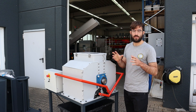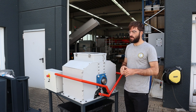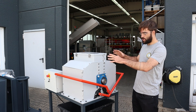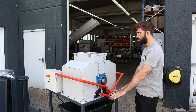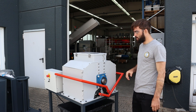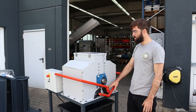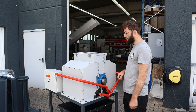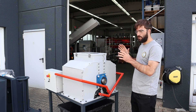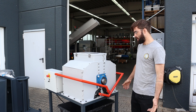Now Weimar is going to work on a second version of this shredder to improve the ergonomy, the safety, and the use of the machine — simplify it a little bit. Globally, the shredder will be lower, there will be a tall hopper to be able to load a lot of plastic in. This system will be simplified — they will remove the bearings and have the axle stick out of the shredder directly. All the metal will also be simplified, using only 12 and 4 millimeter steel sheets.